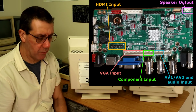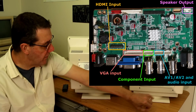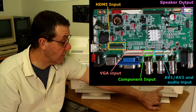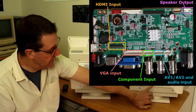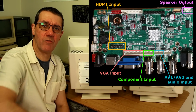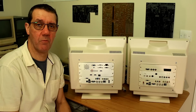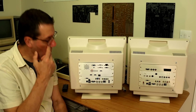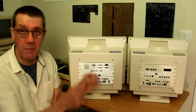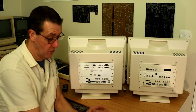And the idea of the breakout board is, on the controller board, one of the things that's so good about it, it has audio visual input. So basically it has two composite ins and a composite out. It has VGA, it has HDMI. But internally it has the same ones all over again. So it means that from inside the case, you can expand on them. So we've got this breakout board. Now at the moment I've hardwired cables to connect there, and they plug inside. The breakout board is going to be long, it doesn't really matter, it's a long skinny board.